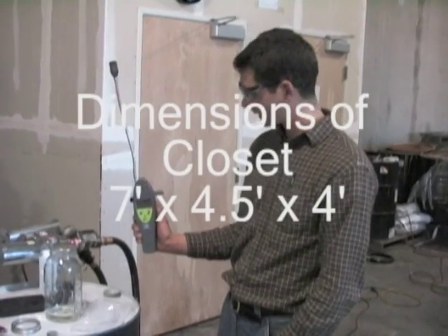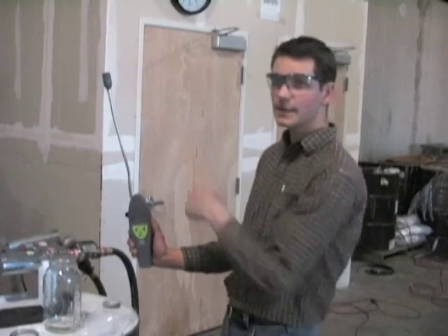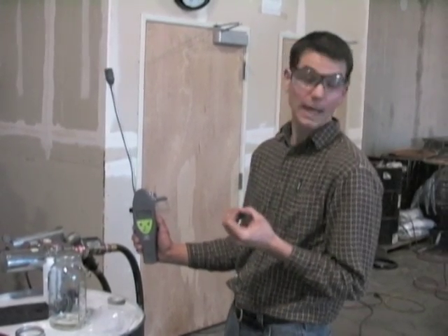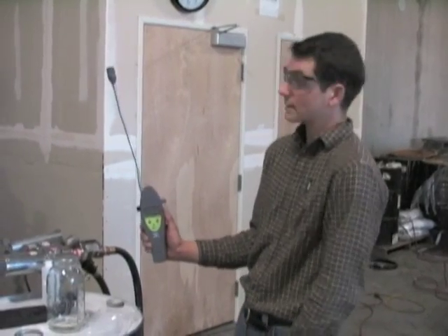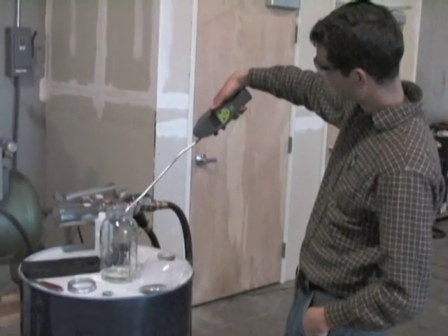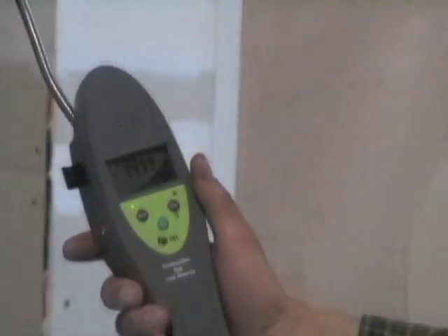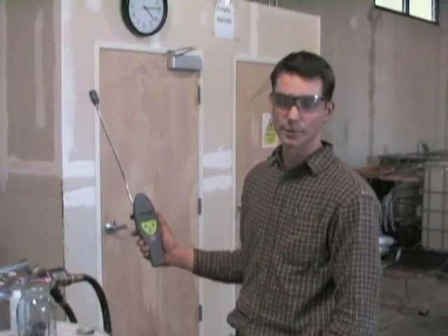What I have here is called a combustible gas leak detector. This device has a little probe on the end which samples the air and measures how much combustible gas there is in the ambient air. It gives you a readout on the screen in parts per million. Here in ambient air we're at zero parts per million, which we'd expect. To show the sensitivity, here's a jar that has a little bit of methanol at the bottom — and we see it immediately pegs out the highest reading available, then plummets back down to about zero to one parts per million after we take it out.